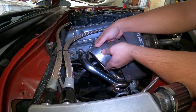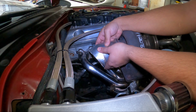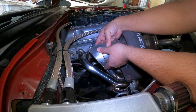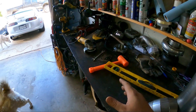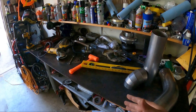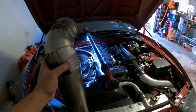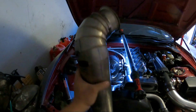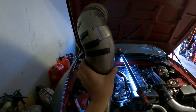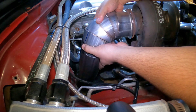Something like this brings me out a little bit so I'm definitely going to need to make some more pie cuts — two or three more so I can put it out straight, and then probably another two or three at the bottom. I'm going to make six more just to be safe. Now if you make them properly — these are nine-degree pie cuts, nine on each side — so if you put five of them together it should give you 90 degrees. And there it is: I ended up using five pie cuts. You can see the curve — how it goes out and then down. Very very happy, I did not struggle with this at all.